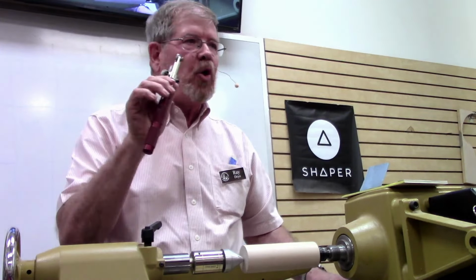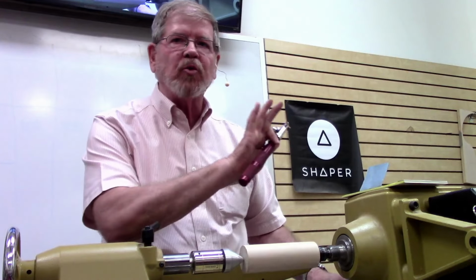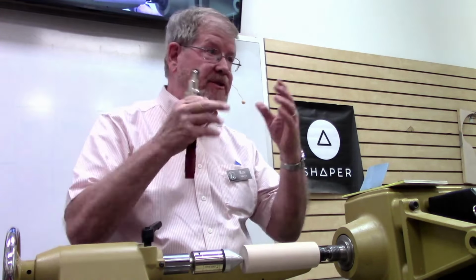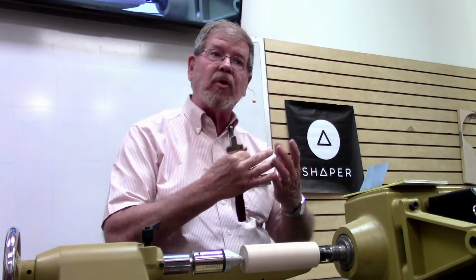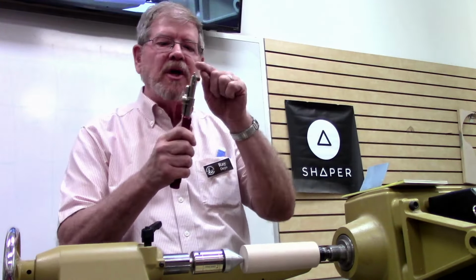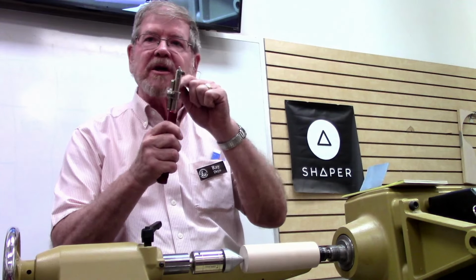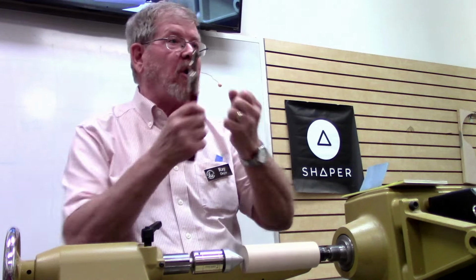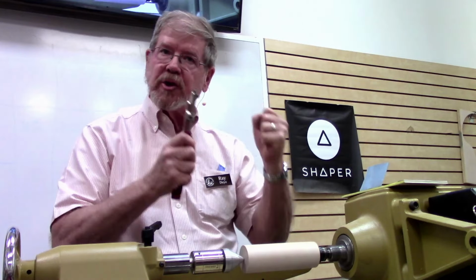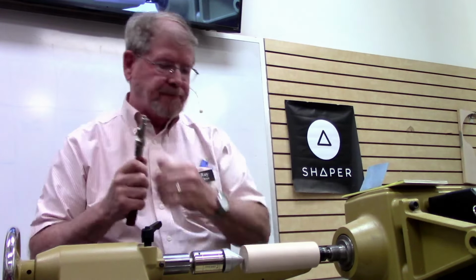Two, it's only designed for a straight cut. You can't change diameters. So you can't do the outside of a bowl, can't do the inside of a bowl, you can't do the concave, because if you change diameters, you will change the speed at which the cutter rotates, and it will crosshatch. So it's only a straight cut. So it's slow, it's a straight cut.